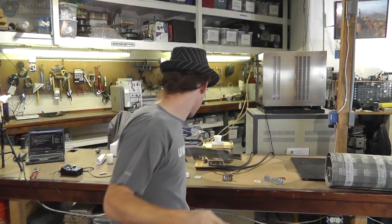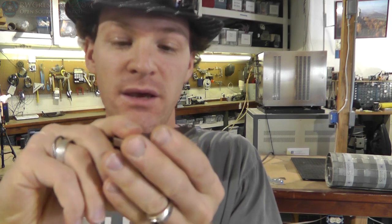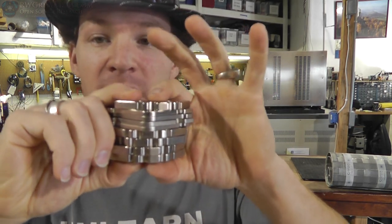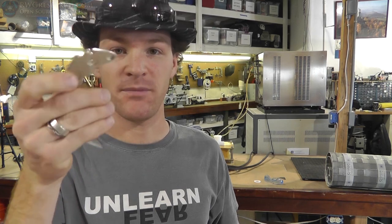So when I try to magnetize something and I've got a stack of mu metal, basically the flux just goes straight through it and out comes a nice field — that's why that magnet magnetized. The shielding I need is a slightly different configuration to make sure it's non-aiding of the process and actually doing its job. Some people may wonder: this is magnetic shielding, why is it magnetic? Well, that's part of the problem — trying to pass this next to a magnet to shield it creates its own eddy currents, it's attracted to it, and all sorts of bad stuff. Just thought I'd share that with you in case you didn't know.